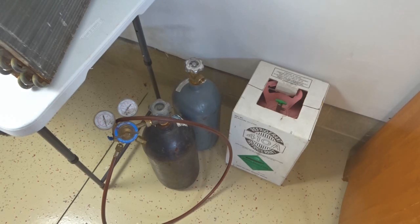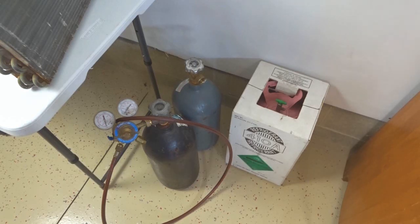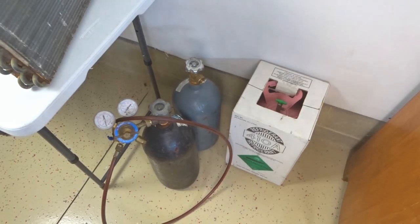Now when we let 410A out of this coil, the mixture may not be released in a uniform way. That is a concern since this refrigerant fractionates. What I will tell you is that it will be uniform within each test — as we release the refrigerant we'll be testing all detectors on whatever mixture remains — and in the championship that'll be uniform as well. So even though from one test to another it may not be equal, in the final test it will be equal, making it a fair representation of the best leak detectors.